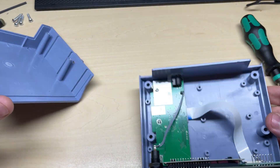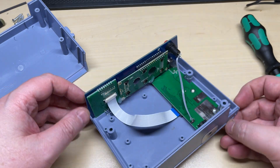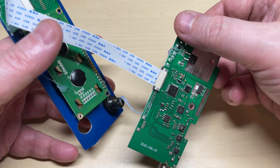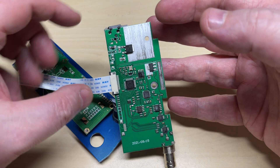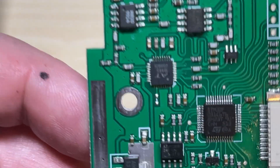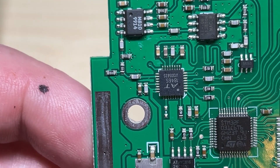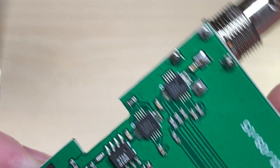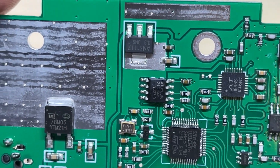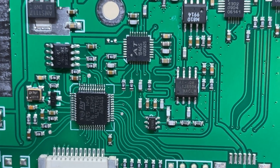Let's get it apart and see what's in here. There's an LCD display with a parallel interface, a ribbon cable going to a board, and when we turn it over there are more components. We have an STM32F processor, a couple of RF components, a regulator, and then these two components here — 4302s — which appear to be linked in series going to the RF socket. We also have a 78M05 regulator, so I think we've got 3.3/5 volt regulators there.